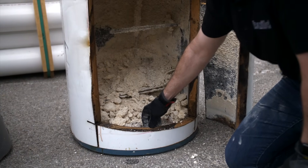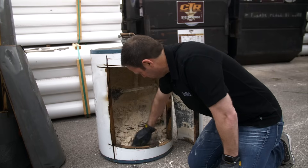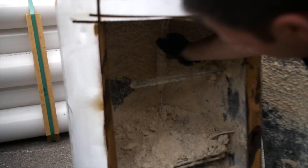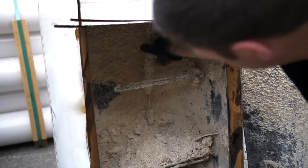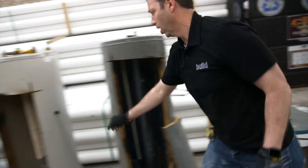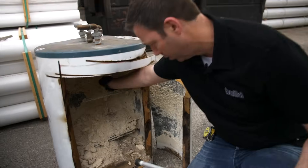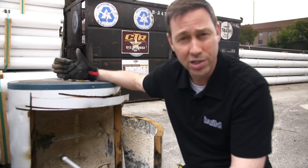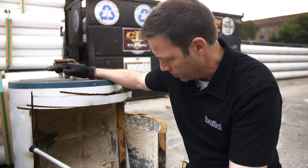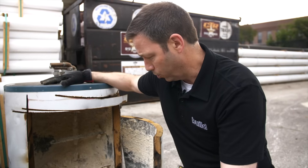You've got a steel tank on the inside, steel tank on the outside — looks like somewhere between an eighth and a sixteenth of an inch thick — and then there's spray foam insulation. The tank also has a lot of rusty color on the bottom. What's preventing that rust on the inside? It's the anode rod. This looks like it might have been the original rod, with the bare wire showing. A new rod goes from full aluminum to just wire over the course of time. My guess is this tank was never maintained, never flushed, and that anode rod never came out. It did last a long time — 17 years — but had this tank been flushed and used with a softened water system, we could have gotten more life out of it and it would have worked way more efficiently.